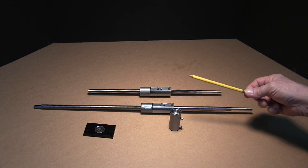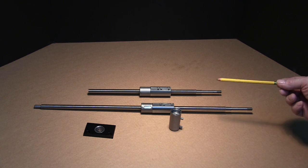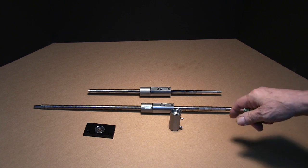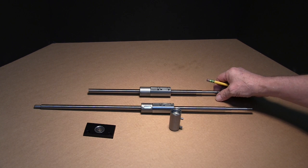Each rotation is 2.5mm — that's about 98 thousandths, a little over. So if you have a 400-step stepper motor, each step is going to be about 2.5 tenths. We try to keep everything pretty close.